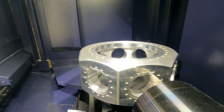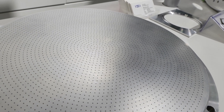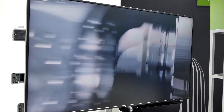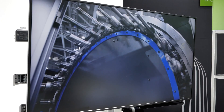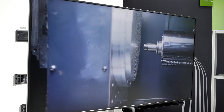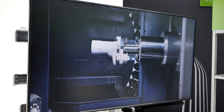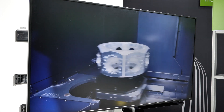Can I ask about the seal and the special tool? I think the audience would want to know. When I first heard 'shower head' in the world of Semicon, I thought I was drilling holes for a shower, but it's gas that goes through — and the precision of these holes is critical. There cannot be burrs, there cannot be vibration, there cannot be any issues. The seal operation is equally important. Previously you would have gone to a turning machine for that. Now, to avoid this, we have implemented it in our machine with a special function, special tool, and special tool holder, and you can do it in one setting. Don't move the part to another machine — it's loss of time, loss of accuracy, loss of efficiency, and in the final end, also dollars.